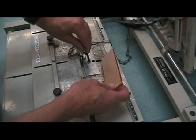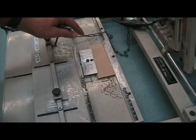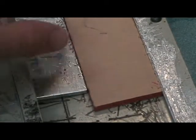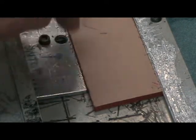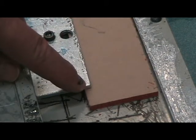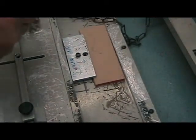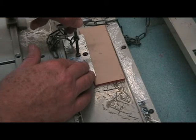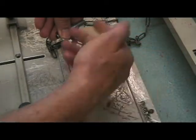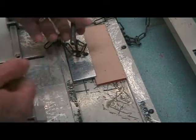The first thing you're going to do is locate your plastic and center it in the machine underneath the hold. The plastic should not be positioned to the side — notice that the clamp is not doing any holding power when it's at the side. It needs to be on top of the plastic by a little bit. When tightening the clamp, you don't need to overdo it. Just a couple good twists to make it snug. Sometimes you need to hold the clamp from underneath so it doesn't spin. Snug it down until it's firm — you don't have to wrench it super tight.